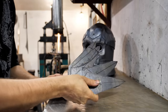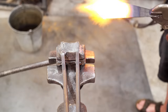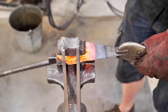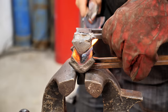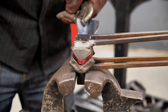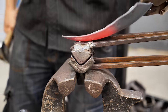I've cut the parts of the teeth of the crown, this is also mild steel 2.5 mm thick. In a special device, I bent it in the middle with heating and give a rough shape to all the plates. Each piece is heated 2 times. It would have been possible to do this on the press, but I wanted a distinctive hot forging surface. After polishing, it will be clearly visible.